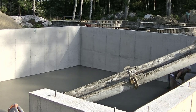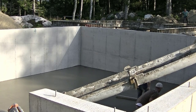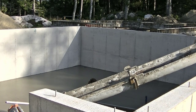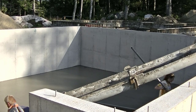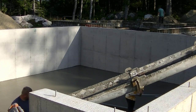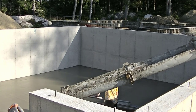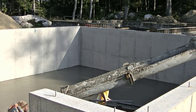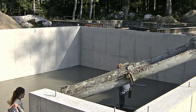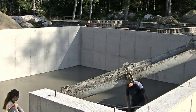So those are my seven basic tips for concrete floor pouring. When I first started out, if I didn't have the tools I would go rent them, and then as I got into business for myself I would buy them as I could afford them. You can rent most of these tools at a tool rental place — the screeds, the bull floats, the come-alongs, the extra chute, even the laser. As you can see, we're not using a shovel here — I wouldn't really recommend using a shovel to pour a concrete floor. You could probably even rent a mag float, and if you can't rent one, they're pretty cheap to buy online. I have links for all these tools down in the description. You don't really need to buy them if you're just doing this once — you can go ahead and rent them.